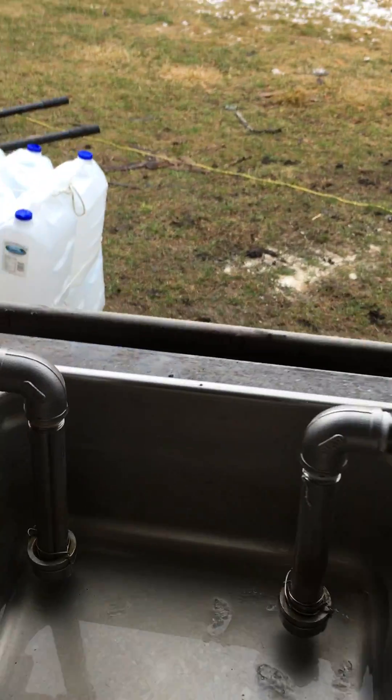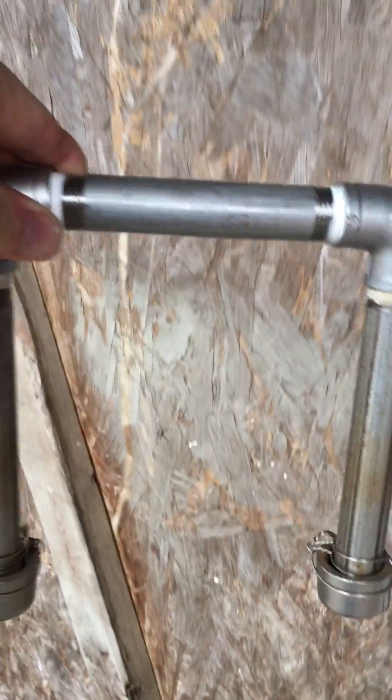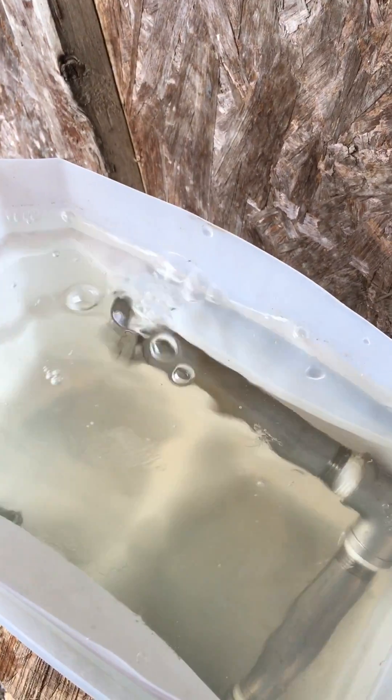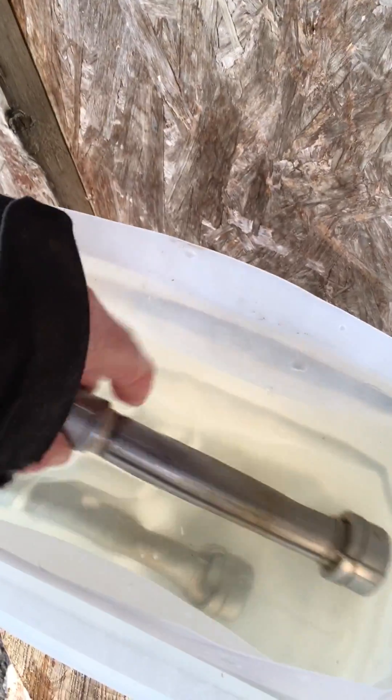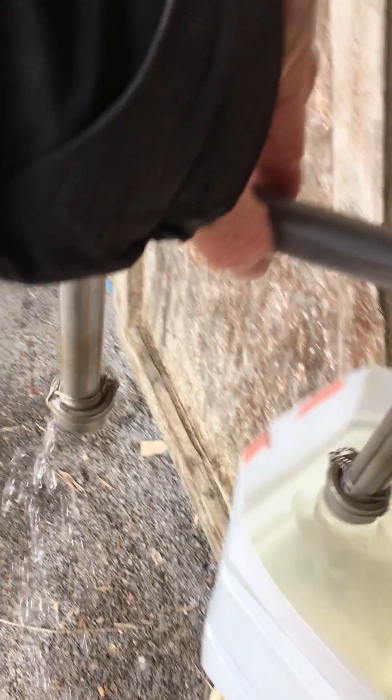There's a good look at it. I take these siphons and I immerse them in sap. You can see the air bubbles coming out, so I'm trying to bleed all the air out of the tubing. Roll it around here a little bit until I get that last drop of air. Then I set it up and you can see I can test it here — if I immerse it in this container I'm getting sap flow.